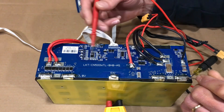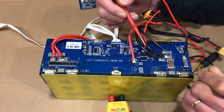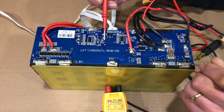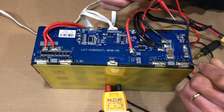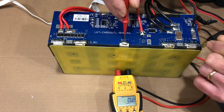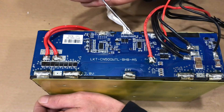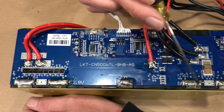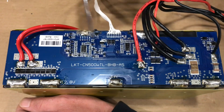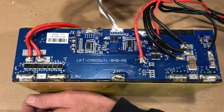Here we have the lithium iron phosphate battery pack. It is composed of cylindrical 3.2 volt LiFePO4 cells, also known as 32700 cells — 6,000 milliamp hours per cell. It's wired in series-parallel: the battery is broken up into two series packs and then paralleled together. The voltage reads 8.82 volts DC, and the center tie point is 4.18 volts, so the cell pack is flat. This is the battery management system — the BMS — built onto the battery. You can see where all the solder joints connect to the battery, and here are the outputs. It's got fuse links and temperature links built into it. This is the BMS — it controls the battery. If it sees an under-voltage, over-voltage, or over-temperature condition, it has leads and ribbon cable going to the main control board and it would disable the cell pack.